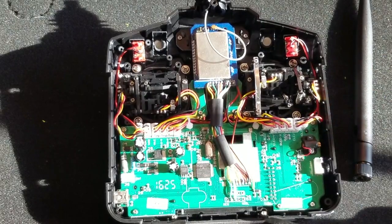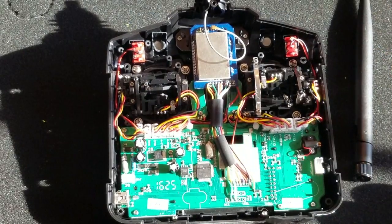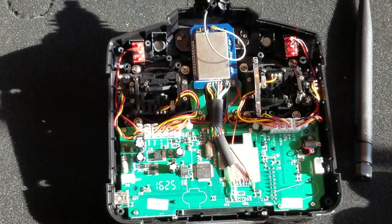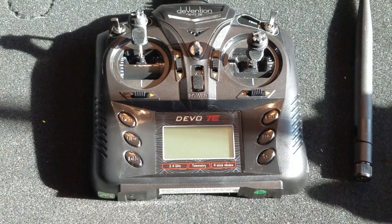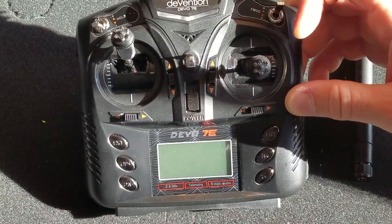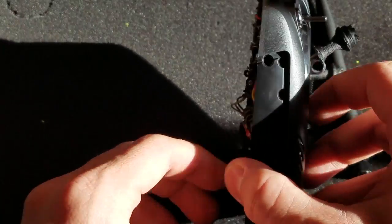That second ground and that five-volt power point goes to my LED, which is mounted underneath the module. I used a small resistor to extend the life of the LED — it's a small 1S LED. Just drill a hole in the plate, clip the little plastic piece that houses it so it fits, and you're done. The other thing people were asking about are my stick tops — these are 3D printed pieces from a friend, possibly from pb3d. They have a finger groove on the side, which is great for getting into pinch flying. Very ergonomic and comfortable.